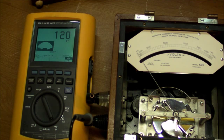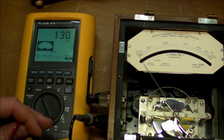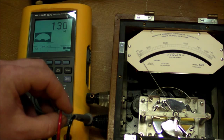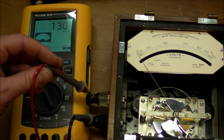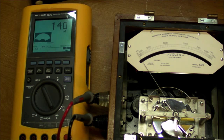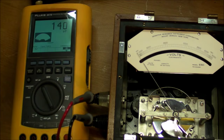We can show it with this Fluke 867B right now, just with the probes hooked up to the input. We're getting 130 picofarad, 120, 130, 140 — that's just because I'm moving the thing around and it's becoming closer or further from the black lead. Let it stabilize and plug it back in — and there we go. It jumped 10 picofarad up because that's the closest precision it can get, down to the 10 picofarad range, not the one picofarad. So roughly 10 to 12 picofarad — certainly not 30 to 35 picofarad.